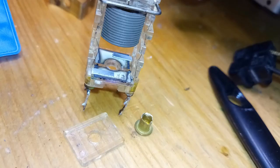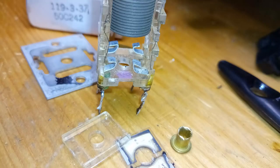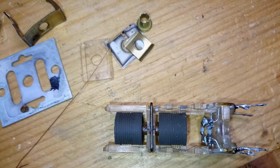This issue also involves the IF transformers used in important receivers like those made by Hallicrafters. During a restoration, these intermediate frequency transformers must be inspected and usually, the capacitors must be replaced. The current slideshow represents the process for removing these capacitors, replacing them with new ones.